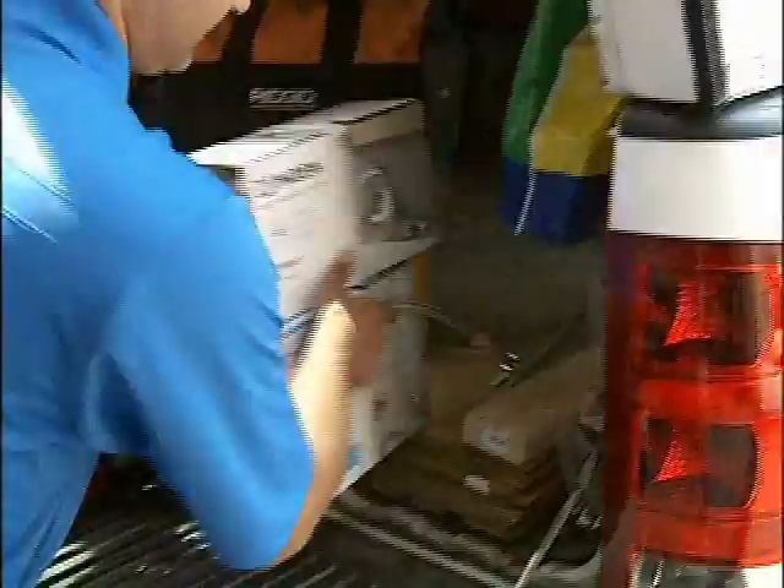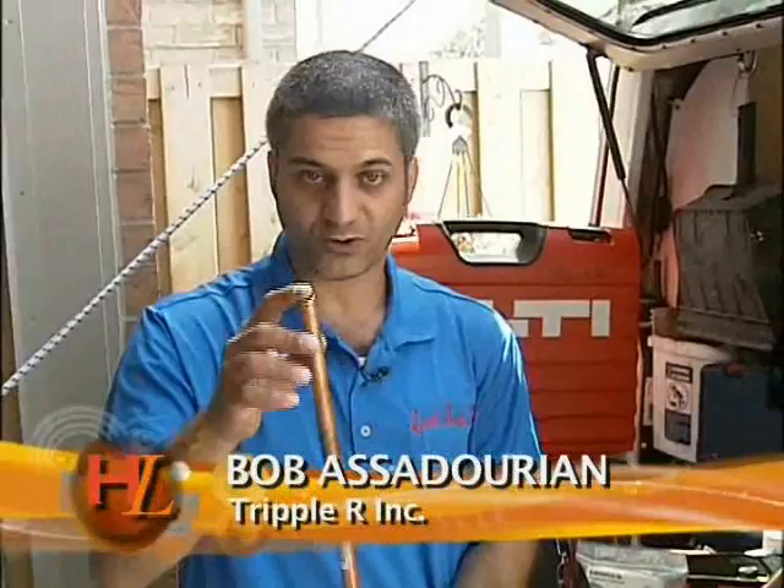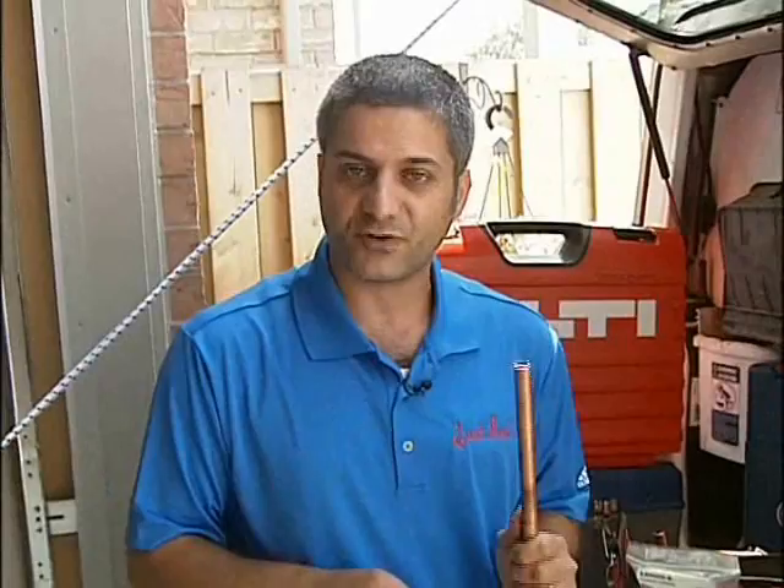Hey, Bob back here on the job site. Hope you're enjoying the show. We're about to install some faucets. Have a tip for you: copper piping, whether hot or cold, is under pressure. Please trust me when I say make absolutely certain the water supply is completely off before you cut into the pipe. We have a few more segments for you to enjoy. While you watch those, I'm off to change my socks — I hate having wet feet.